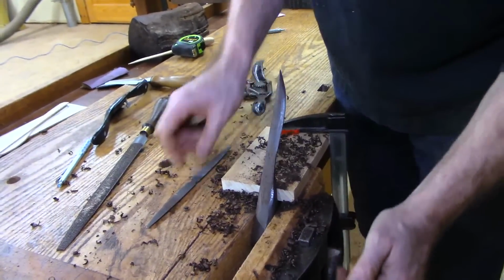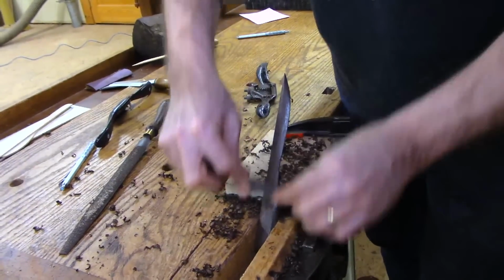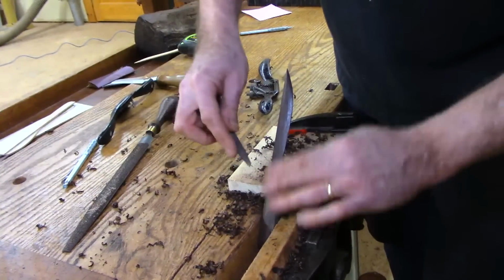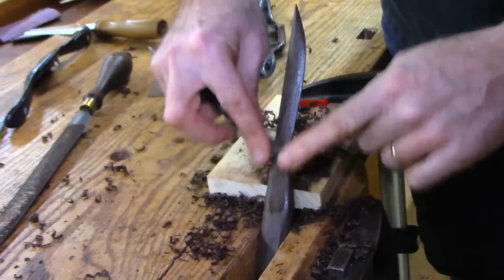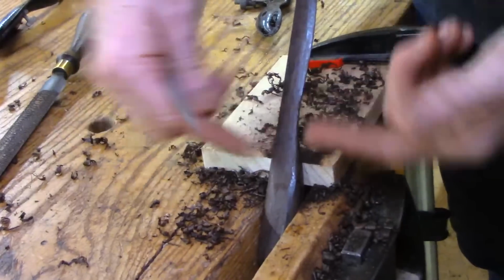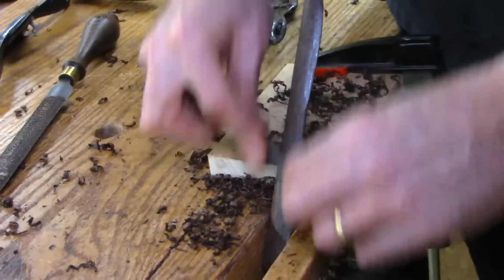Danny's curious between butterfly joints or double bevel marquetry. Either of those ways you would? If I was going to inlay this, I wouldn't use double bevel marquetry, because that's usually reserved for veneering, like you're veneering a whole panel and you're pre-cutting it into a layer. I think with this being a solid, I would be trying to put a solid into a solid.